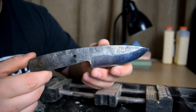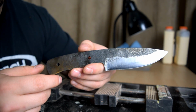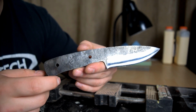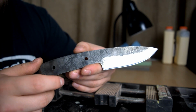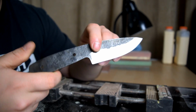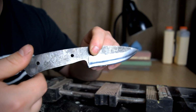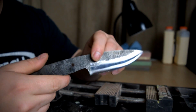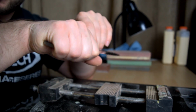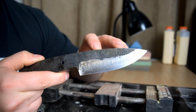Have a look at this knife. I'm calling it Necker Design 1.2, and that's if you saw my original Necker video, if I think about it, I'll throw a picture here somewhere. It was a slightly different shape, just a touch different handle. Notice this handle has a little bit of contouring. It's a little bit bigger, a little bit more contouring here, just to fit the lock into that hand a little bit better. Still closer to a 3-finger grip. I can squeeze 4 on there. And this is more of a saber grind than the convex I had on the original.